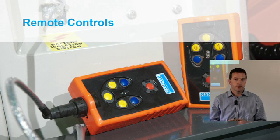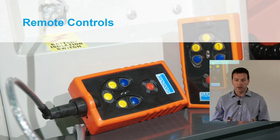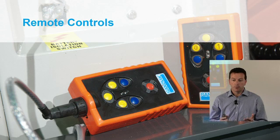Another essential feature of our QE341 is a radio remote control. I say essential feature because within Sandvik we consider safety to be an absolute priority. With our standard radio remote control, you can operate the machine safely. You can track the machine with full 360 panoramic vision by walking with your radio remote control. If you're loading the machine onto the low bed, unloading the machine, setting up the machine in a train, you have full visibility of all the obstacles or people around the machine, making for a safe tracking operation with the radio remote control. There is, of course, also a backup that has a lead in the event that there's a problem with the radio. But a standard feature, you get the radio remote control and you have the backup.